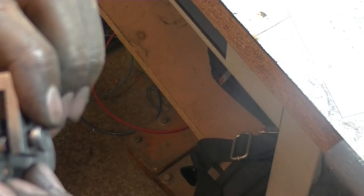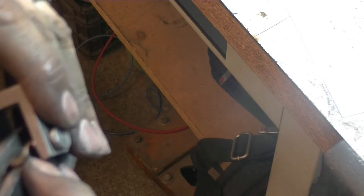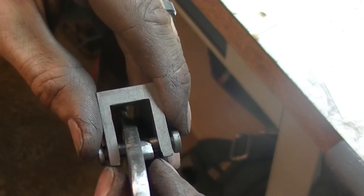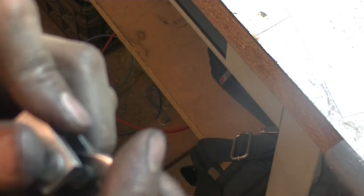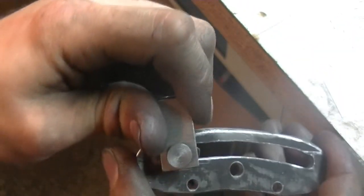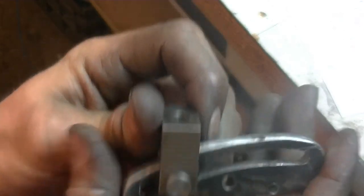However, what I don't like is that it's able to wobble like this. I think I want to put some spacers in there to sort of sandwich it so it can't move back and forth. I'll do that on the lathe. Otherwise it works pretty good — a little stiff in some places, but I still have a lot of tweaking to do with the file. This is coming along.